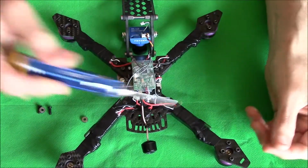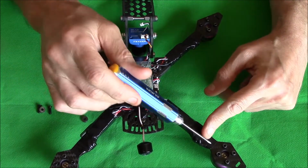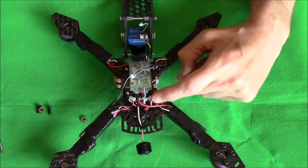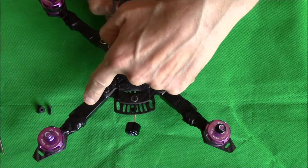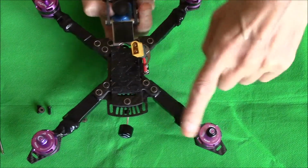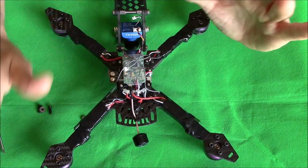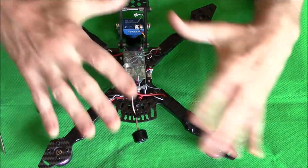So that's why, as this is mounted, this would normally be motor arm 1, motor 1, right? And as I've connected the ESC to the flight control board, it's actually connected to number 3, because as I turn it over, it's become number 3 now, because that would be 1, 2, 3 and 4. Alright, so 1, 2, 3, 4, as I turn it over and connected it up, that will become number 3. So that's where you have to do the alterations in the software.